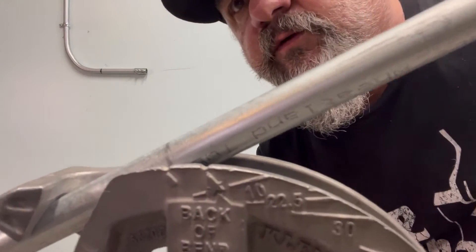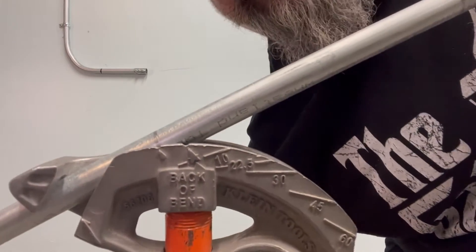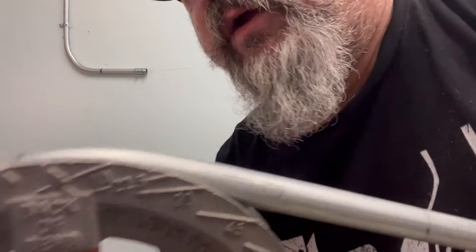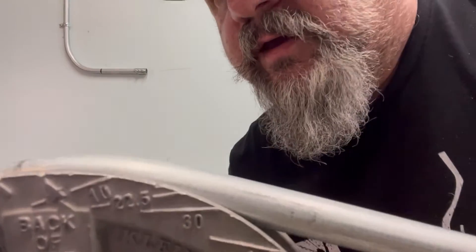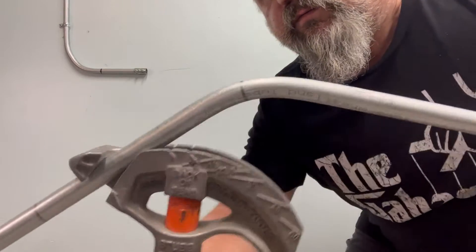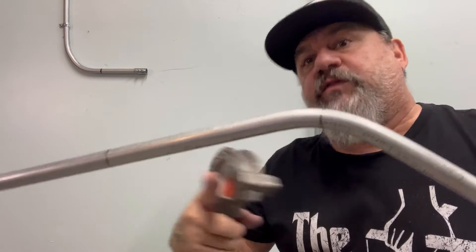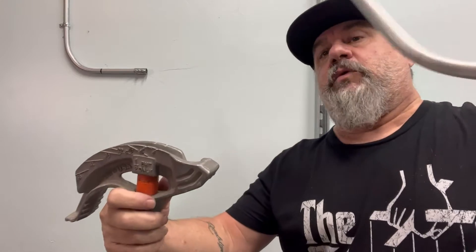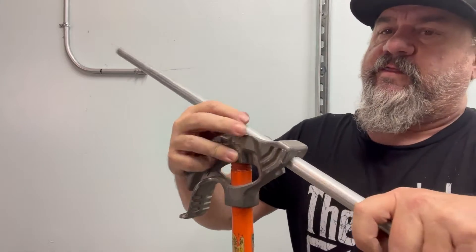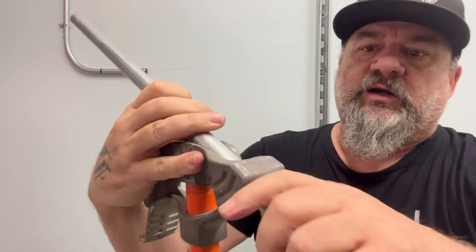There's our center mark, there is our rim notch. We grab hold of this, push it down to parallel with that 45. Maybe a little more — we're pretty much parallel with that. Now for the other marks, we're going to go 22 degrees just like we did that. We turn it around and put it right here at the arrow where we start all of our other bends. We put that square and start our 22-degree bend.